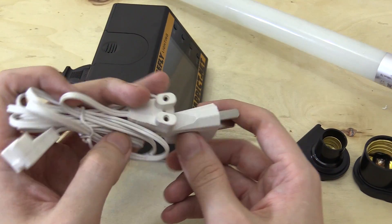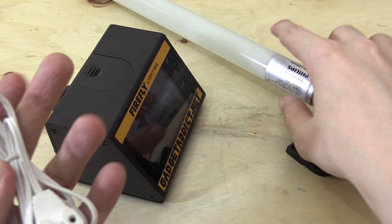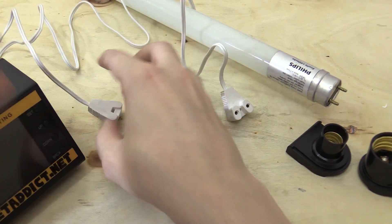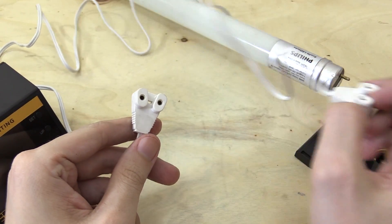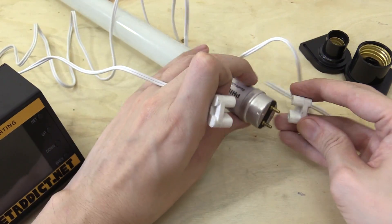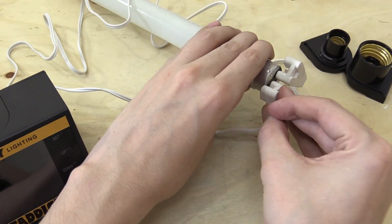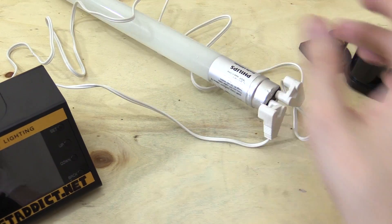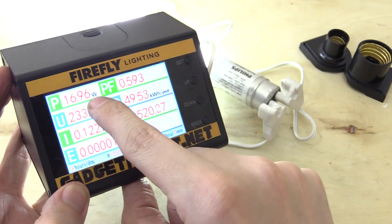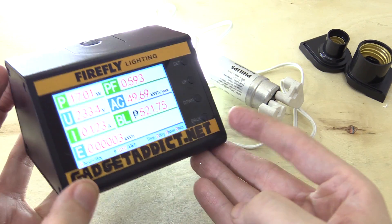Aside from plugging adapters into the top, you can also connect a load at the back and measure that. It also comes with a wire for testing LED tubes — these are LED replacements for older style fluorescent tubes. I'll plug this wire into the back. Note that on my Philips tube I have to put both connectors on one side, with one on each pin, so do be careful not to damage older style tubes. When I turn it on you can see the Philips LED tube comes on and we're currently measuring 16.97 watts, along with power factor and cost per year.